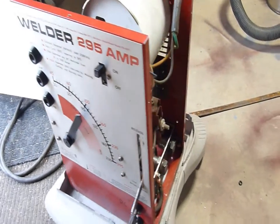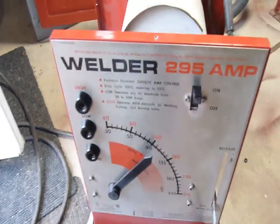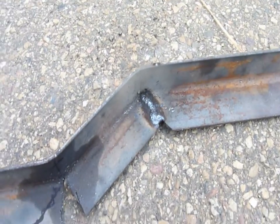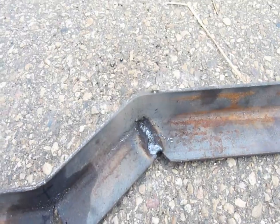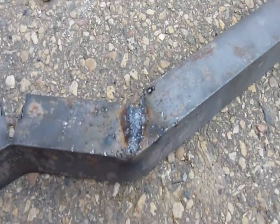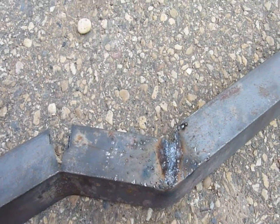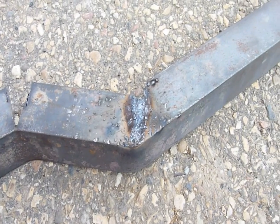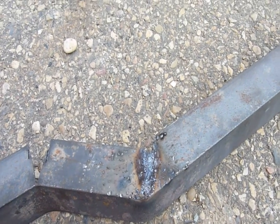There it is, humming away. I've done a bit of a weld — 100 amps, 1/8 inch steel — seemed to work good. This is actually thinner rod than I should be using; it's 1/16th, that's all I've got. 6011. My book says DC should have electrode positive, so that's what I did. Better welding for sure — not as much arcing and mess and splatter. These spots here were me trying to start it with an old rod, not being able to see. There you have it — seems to work, it penetrated pretty good. I could crank up the current a bit, which wouldn't be a problem.